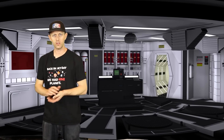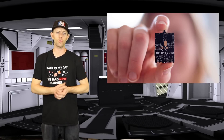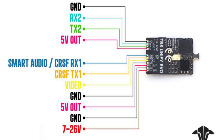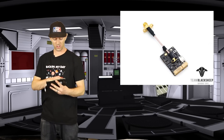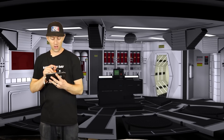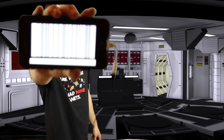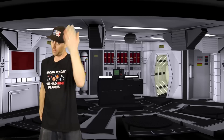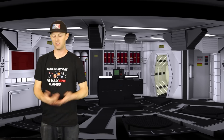On the other end of a goggle situation is the TBS Evo VTX transmitter. This one weighs seven grams, can take 2S to 6S power, and can output 25, 100, 400, and 800 milliwatts. The best part: if you want to change channel you can throw a barcode up to the camera and the camera changes for you all by itself — no special camera needed, the VTX recognizes it similar to a QR code.